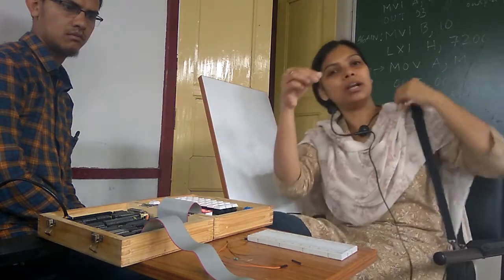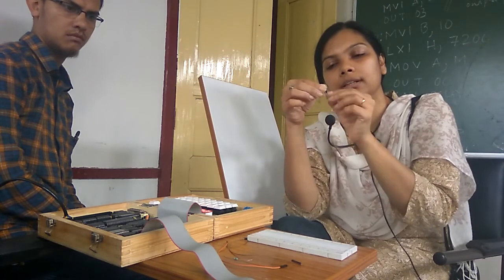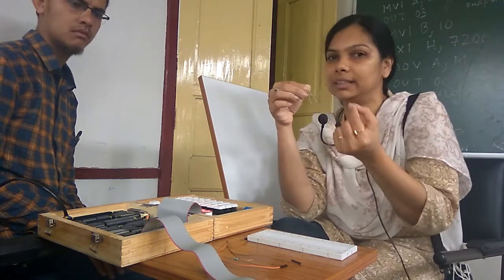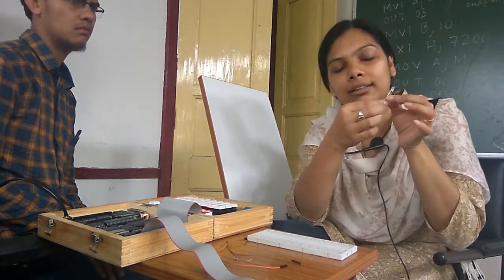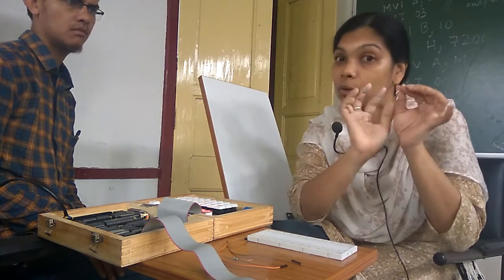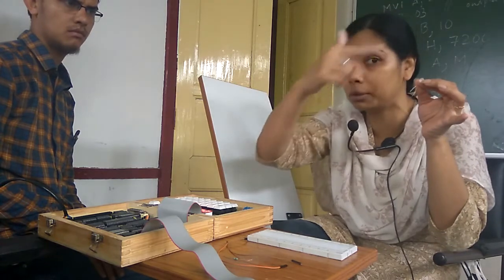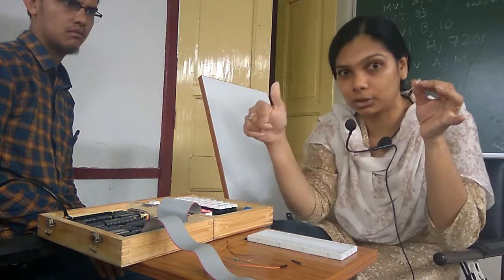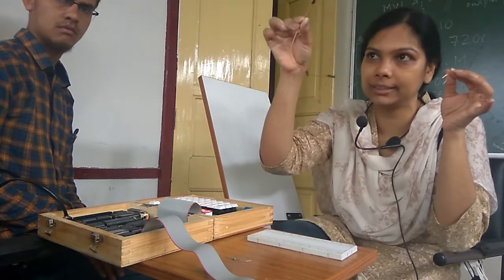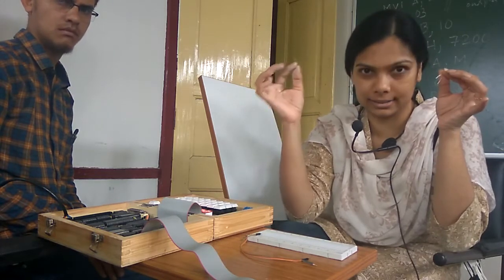Okay. So what we will be doing, this anode we will be connecting through a resistance to the VCC. So one part of this LED, that is the anode, will be connected through resistance to VCC. Then what we will be sending to the other port should be 0. Then only this LED will glow. There should be a path, a current flowing path between your anode and cathode. Okay. So in this experiment you will be requiring two such wires. These are called male-to-male wires, and this is a resistance.